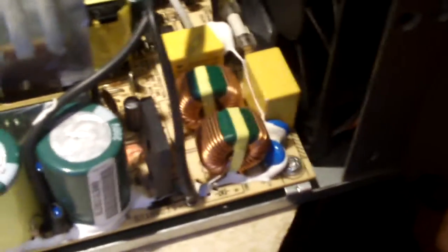As expected with HYPRO, it's built pretty well. The fuse you can change out without using a soldering iron — something you used to see in older power supplies. It's got good-sized heat sinks; the secondary side heat sink is massive and can definitely dissipate a lot of heat. The transformers are pretty decent. The capacitors are kind of on the smaller side — those are 470 microfarad caps. Even a Bestech HX312E power supply would have 680s in it, yet these are only 470s. But it's still not too bad of a power supply. I'll change out that one capacitor to see if that fixes the problem.